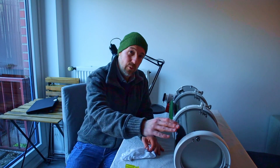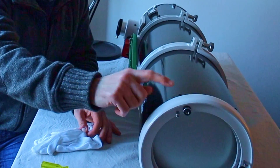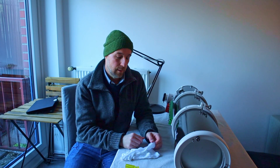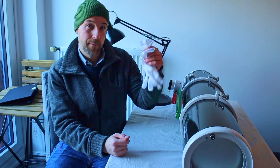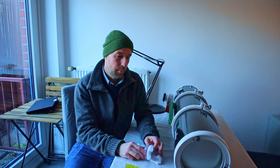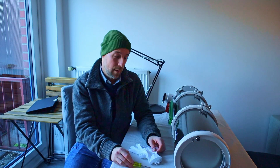What I will do is disassemble this part here with the main mirror — loosen these screws, I think it's six screws — then remove the main mirror part, the whole part here. Then I will just unscrew the fixation a little bit. What you will need for this is some gloves, at least when I have the part with the main mirror in my hand. And what you definitely need is such a screwdriver — this is in the box of this telescope. So this I will do first.